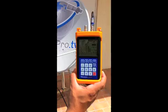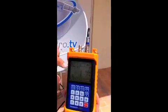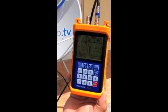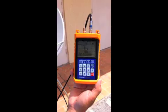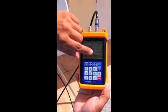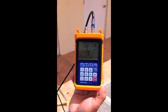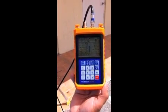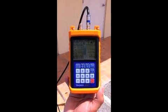In most cases, we are still picking up some signal. You can hear the tone of the meter — it's very staggered, there's a good gap between the beeps and it's a lower volume. As we get closer to the signal, you'll see the quality bar jump up, which tells us we're on the satellite, and you'll hear the audible tone increase in pitch and in repetition.